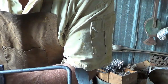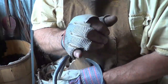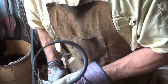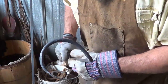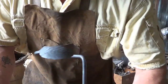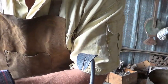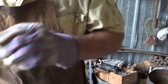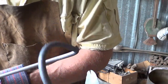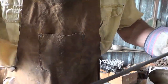When I put that 90 in, a couple of things you need to think about is the amount of space between here and here — you've got to be able to get the stem of the wine glass through. Try to keep it round — it looks better when it's nice and round. On this 90 you want everything to kind of be flat, so when the cup's sitting in there it's flat. So that part's done. This one's going to be for Chandler because I don't like the display — it didn't turn out well. The next step would be to put the point on the end and we're basically done.